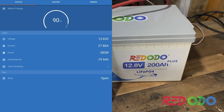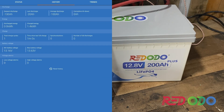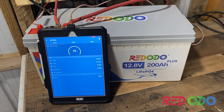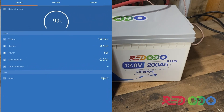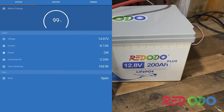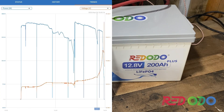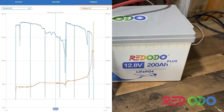I just added 20 more amp hours to the countdown and we'll be able to see the total kilowatt hours. That's going to be it — that's fully charged. We put in about 118 amp hours; the history says we put in 1.6 kilowatt hours, so that's 1600 watt hours. As you can see we have max potential power. I had to readjust the panels for full solar, and you'll see they gradually drop as the sun moves, while the voltage pretty much maintains about the same level all the way until the end.